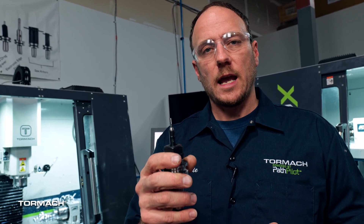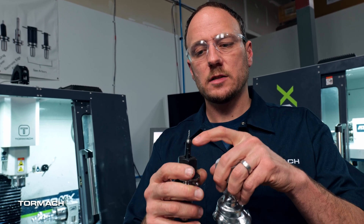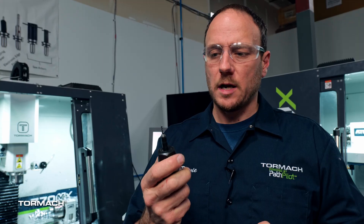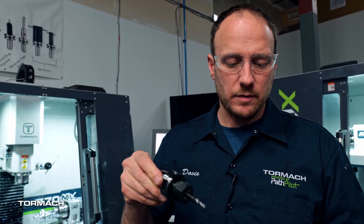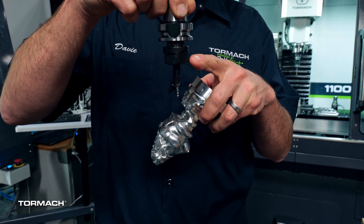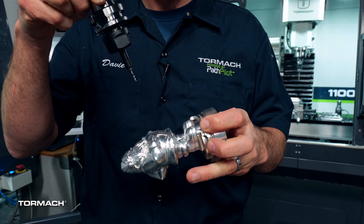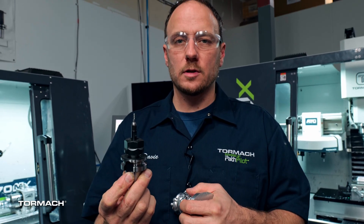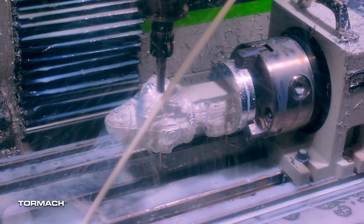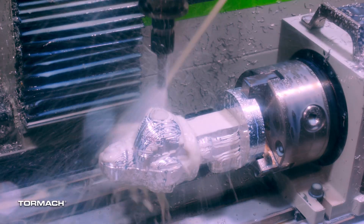For the 1/8 inch end mill - both for the flat and for the ball - I'm using an AB Tools Accu-Hold just to stretch that tool out a little bit. This has a 3/8 inch outer diameter and a 1/8 inch inner diameter. There's a myriad of options on tools like this, but this is my tool of choice for getting down into deep cavities. For example, when I want to get in between his toes, I need to get this all the way down in there without colliding the collet or anything else on the stock or chuck. I only have one of these, so halfway through I'll have to switch it out for the ball end mill and re-touch off my tool length. But this is a one-off part, so that's a sacrifice I'm willing to make.